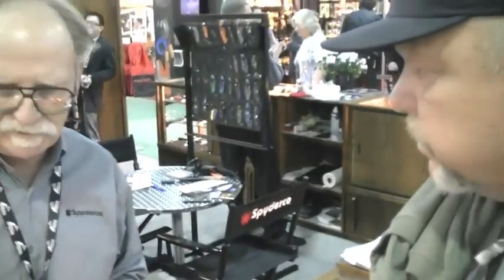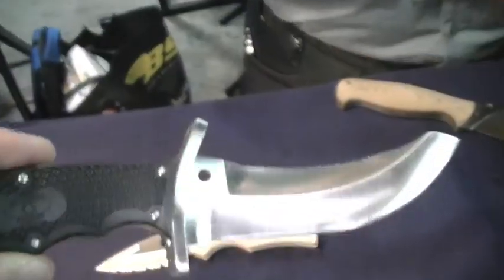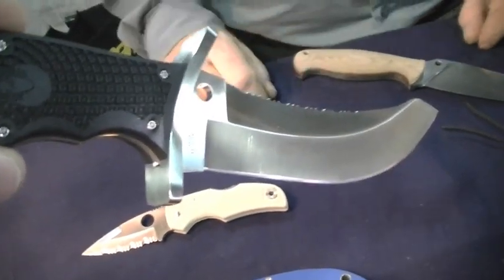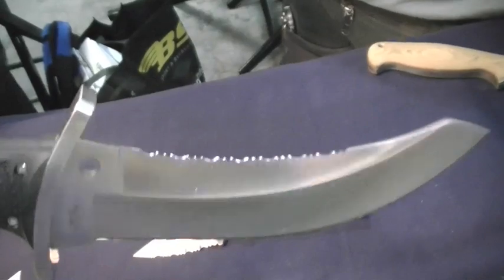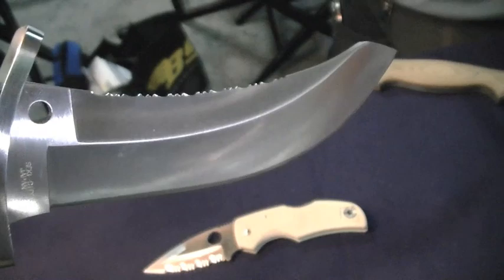What would the Rockwell on that be? The Rockwell when this material is delivered is roughly 58, 59. Oh, it's already hardened. It's work hardened. It's not a martensitic steel that is hardened by quenching. This is hardened by rolling the material. This material, I think, is reduced from 8 millimeters to 4, cold, no heat. And under the intense pressure, it actually creates the martensitic matrix with a little bit of nitrogen and carbon that it does have.